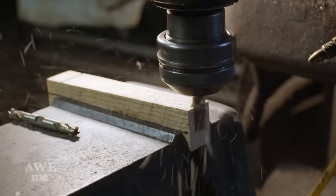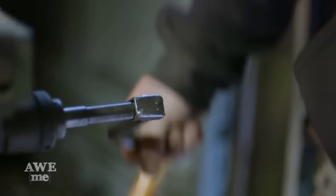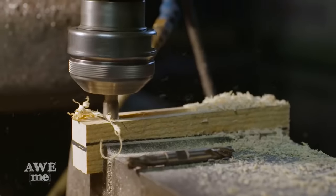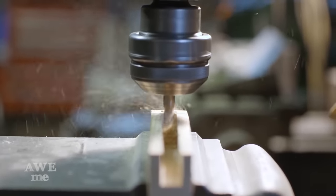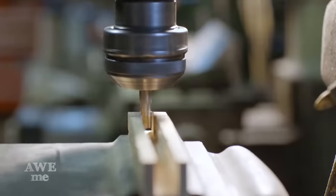Because the tang is tapered and it's really hard to mill a taper, I'm gonna mill it in a stepped hole. I'm gonna use a wide milling cutter the dimension of the tang up front. And then as I get down to this line here, I'm gonna switch out the cutters to a smaller one. It'll get super glued roughly together to be shaped, and then it'll be finally epoxied onto the tang and leather wrapped by Kerry.